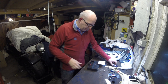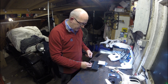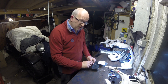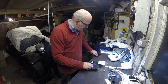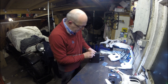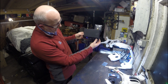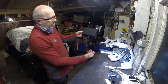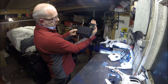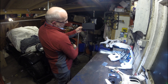I'll quickly power this up. These take a standard two-cell battery, which is what I've got here, with a little JST plug on the end. They have an external power connector as well, which strictly speaking is a little bit better. And invariably you end up breaking the lugs off the back of this — but don't worry. You can see already we're getting diversity happening here. What this is doing is showing which antenna it's using. If I cover this one up and point it away, you can see this one switches off. When I go back, it appears again.